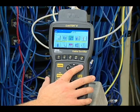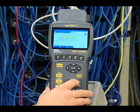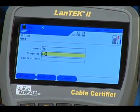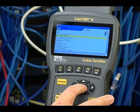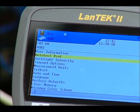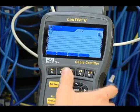Starting with user preferences, you can enter operator, project, and owner information into these fields. This information is added to each test but can also be changed later using Ideal's IDC reporting software. In Auto-Test Preferences, select available options or press Help for further explanation. You can also adjust backlight brightness, time-out options for the display, measurement units, and date and time formatting. The wire map color code is set on this screen using the function keys.